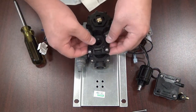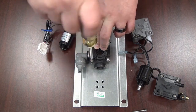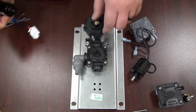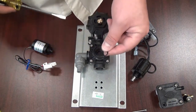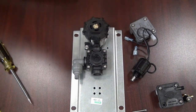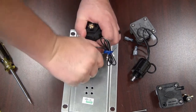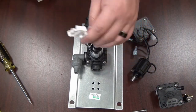Take the bonnet, place it over the valve body, and tighten down these four screws. Now that you have your four screws tightened down, you've adapted it to receive a 9 volt or 24 volt solenoid. With the 9 volt solenoid, place the o-ring that comes with it inside the bonnet in the center, then take your solenoid and twist it on top until securely hand tightened.